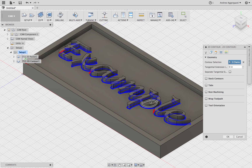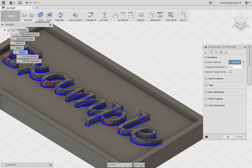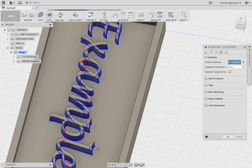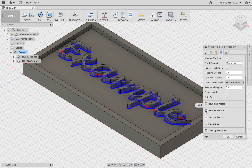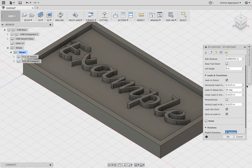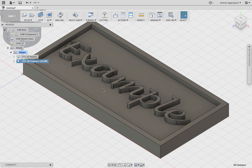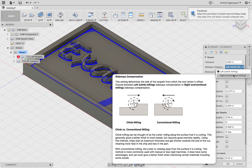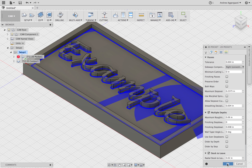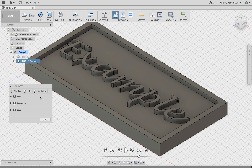For the geometry, you want to select the very bottom of each of the letters — it tells the machine the depth limit for how deep it can go into the material. We're also going to select the inside of the letters like the A, the P, and the E, just to show why it won't work. Change multiple depths to 0.06. For a contour there's no changing the ramp — it'll always be a plunge. Change it to right conventional milling and make sure all of them are on right conventional for sideways compensation.